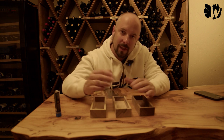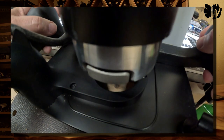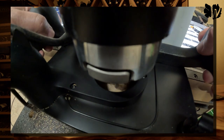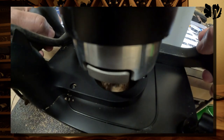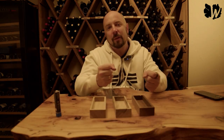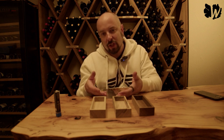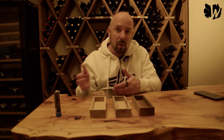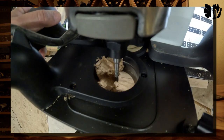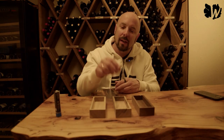I moved to the walnut. Walnut is harder, much harder than the witch elm. It also plunged really easily into the material like butter, but when I started to remove the material that's when it got more difficult. Because it's harder, I had to put more pressure on the Shaper and more muscle power to keep it in the same place — it wanted to move away, since the path of least resistance was not where the wood was. For the first time I had to stop and do some dust cleaning, which I didn't have to do with the witch elm. It just didn't suck out all the material the same way.